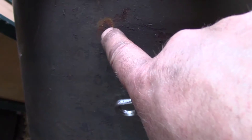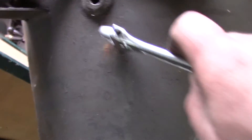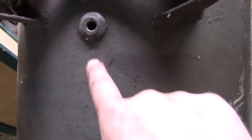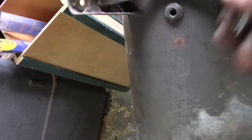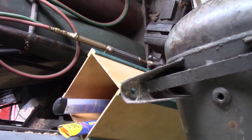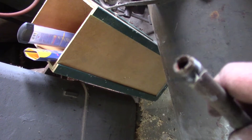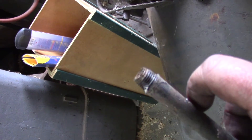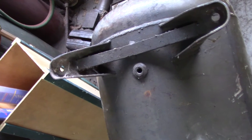The old tank had a pinhole right there — seemingly small but I noticed. I noticed a depressingly sort of funkish sound in a line that runs right through here, and I was really surprised at the sheer amount of rust and erosion I saw in some of my lines. This is the drain line — I don't remember if I put that in or if I was reusing the drain line and valve that was on the tank when I originally got it, but you can see how much it has eroded. It's almost like it was used in a caustic environment — it wasn't with me, just been an air compressor.